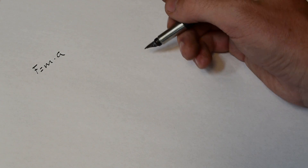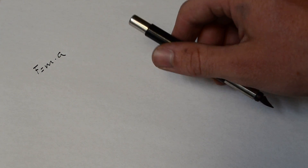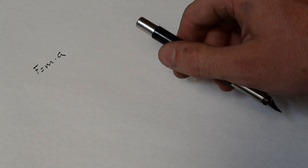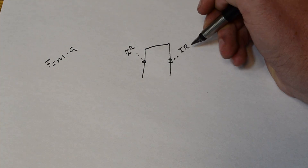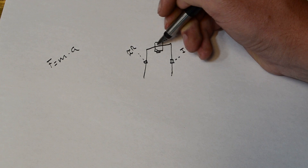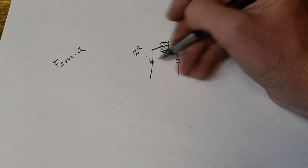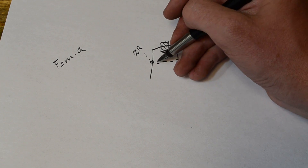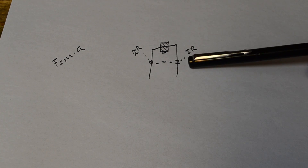Even though we could have it vibrate up and down very fast, it'd be very hard to calculate it out for each object we wanted to levitate, as each object would have a force equivalent to their mass. However, if we can get something that'll detect when the object is at a certain height and turn off the electromagnet, then when it drops below that height turn it back on, it should oscillate extremely fast at that one given point. Basically, here we'll be using an infrared diode, while over here is going to be an infrared phototransistor. Up here is going to be our electromagnet. The electromagnet will be turned on when the infrared receiver can see infrared light hitting it. However, if an object blocks the path of light between them, it's going to shut off the electromagnet. It's going to be quite that simple.